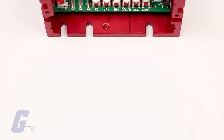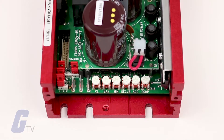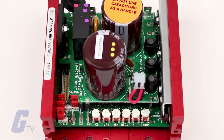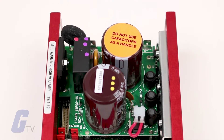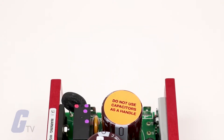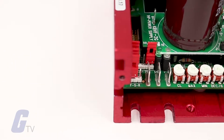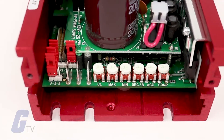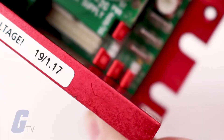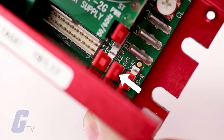The drive is factory set for automatic start using the jumper installed onto KAN1, located on the lower PC board. The drive will automatically start when power is applied and a run command is given, and will automatically restart after a recovered fault due to under voltage, over voltage, or short circuit. For a manual start, a momentary contact must be installed onto KAN1.